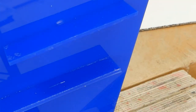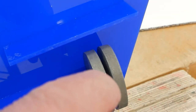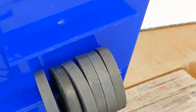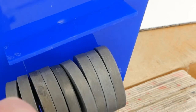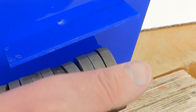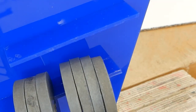We'll try the same with the Tensol cement. So it's all edge preparation, folks. And that is a lot of weight for a very, very small surface area. Solid. There's no movement in it at all. Very pleased. So if it's taking this much weight, my preference would be to go for the solvent cement, simply because I've got a more attractive finish. Again, it's all about the edge preparation, getting the square edge and a polished surface. Okay, that's fantastic. Thank you for watching.